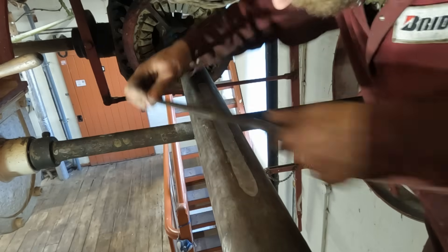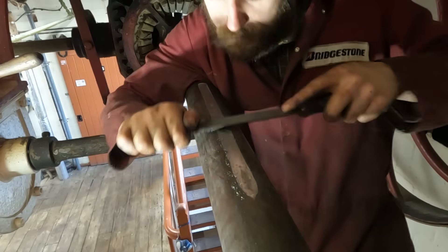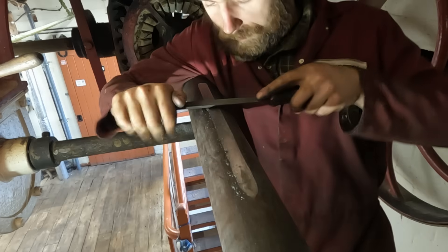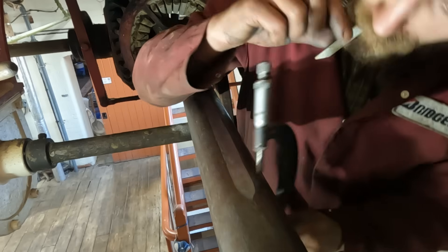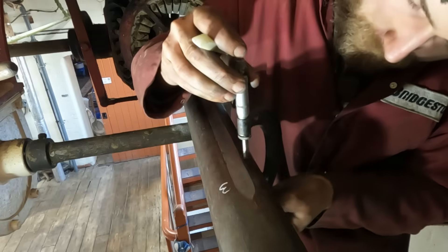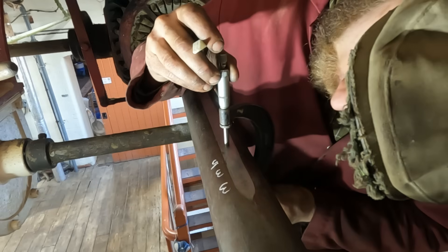The seat is then flattened by filing and then measured to check parallelism with the shaft. I measure the seat every three-quarter inch or so and note the measurement in thousandths above a round number on the mic. The actual depth of the seat is not critical as long as it's wider than the key itself.